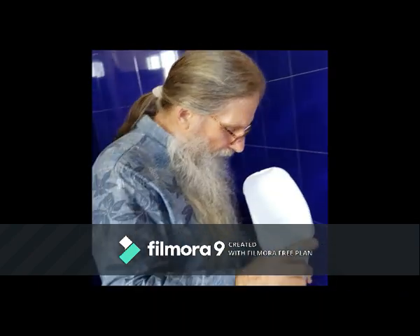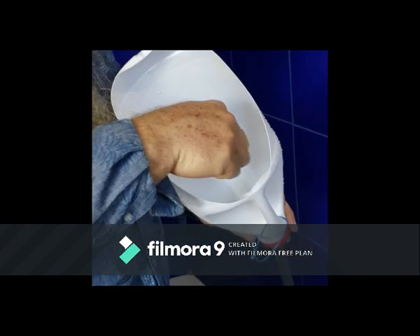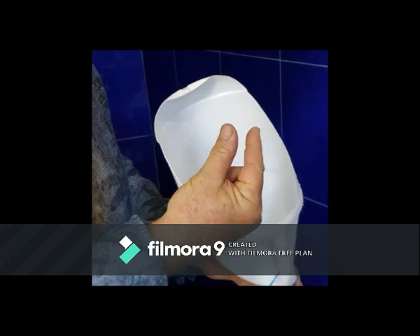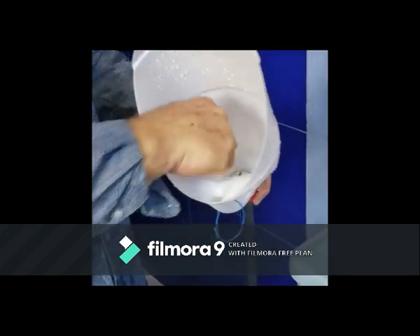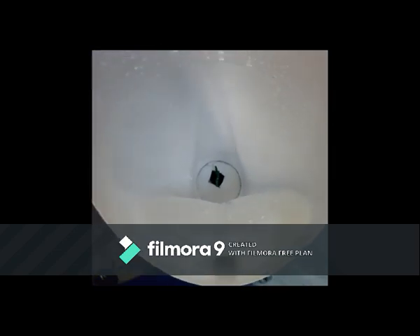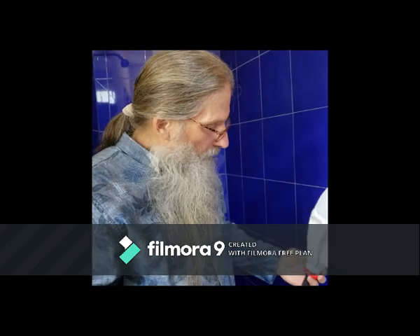Another trick when you do this is to put a stick inside the hose — it just barely fits — holding it very rigid until everything dries. The next day you pull the stick out. Another important detail is this piece of plastic mesh, which keeps garbage from going in and plugging the hole. Very practical, very simple.